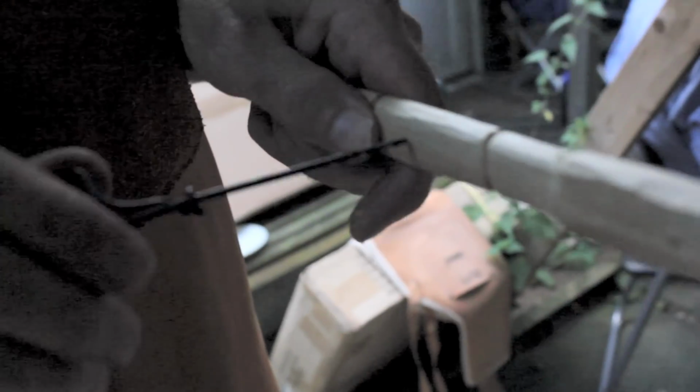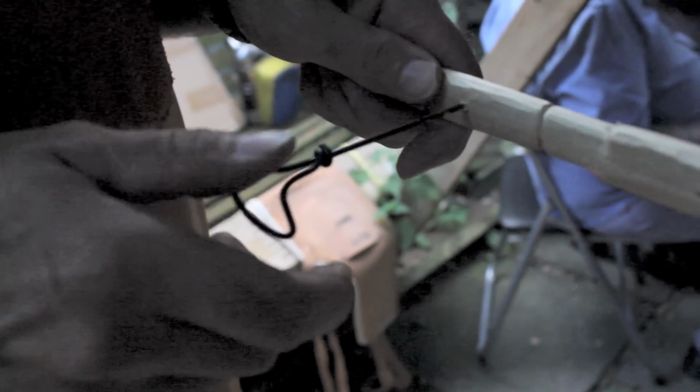The thread that's on the end of it is going to pull it into the wood, and then this spiral flute that's cut into the shank is hopefully just going to help to pull it through and remove some of the waste as it goes, without creating any splits. If it all goes to plan, it's come out the back. There's no splits. So at that stage, we can kind of unwind it.